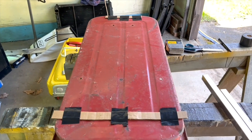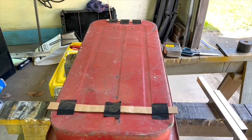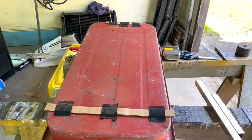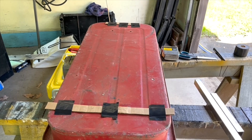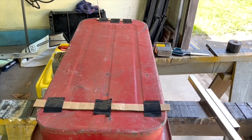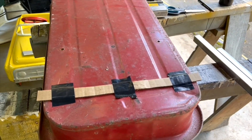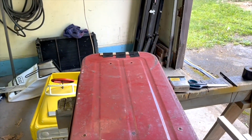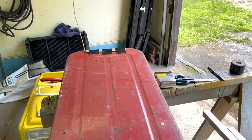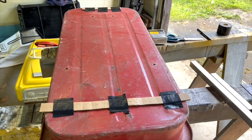I'm going to do bolt-on instead of weld-on for the two pieces of frame going on the wagon. I'm going to put bigger wheels on the back that I got off a golf cart bag carrier. One thing I did — I made a template because I'm going 16 inches in the back and this time I'm going to go eight inches in the front, which will give me more turning radius and narrow things down a bit.